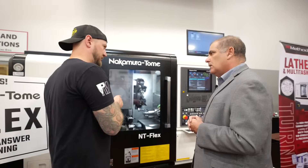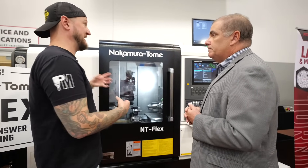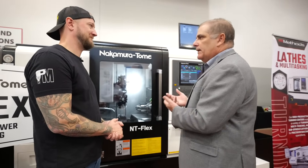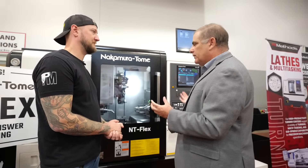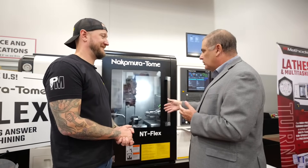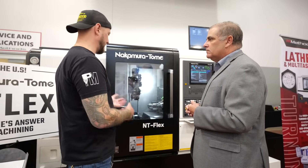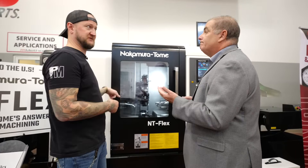When you mention these spindles — it's 8,000 RPM on both. So this isn't really a main spindle and a sub spindle. Correct — just a left and a right. Inch-and-a-half bar capacity left and right, same horsepower left and right, same RPM left and right. This is typically not what we call a sub spindle machine. On a Nakamura with a single turret, we call the right spindle a sub spindle because it's a lot smaller versus the main. But on our twin turret, three turret, even our B-axis machines, it's really left and right spindle because they're basically the same. That's actually better for a lot of applications — you have a lot more versatility. You're not trying to cram all the heavy operations onto one side. You split the cycle time between two spindles for even higher production.